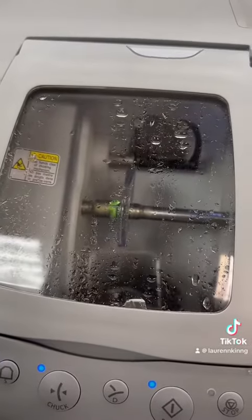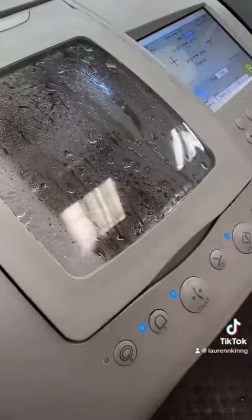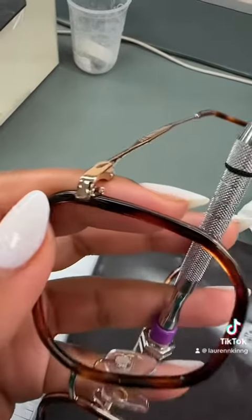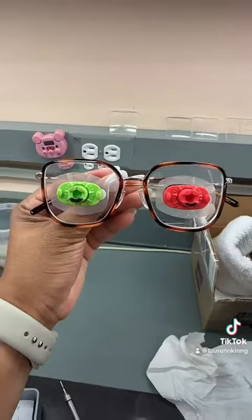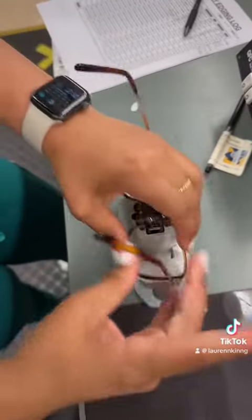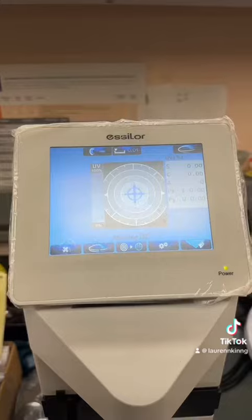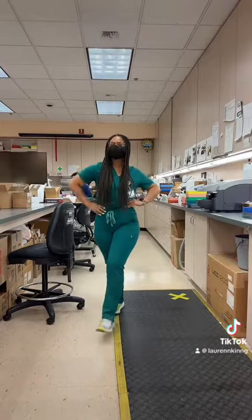During the edging process, the lens will be cut down to the perfect shape of the frame. Once this is complete, we'll remove the lens from the edger and pop it into the lens frame. In my case, I chose a metal frame, so I had to do a little unscrewing to fit the lenses in perfectly. The next step is to remove the blocks from the lenses. After removing the blocks, the final step will be to verify and clean the lenses with the lensometer and cleaning solution. And now I have a perfect pair of glasses to wear around clinic. See you later!